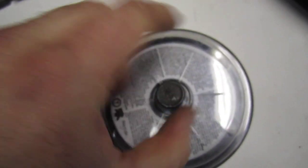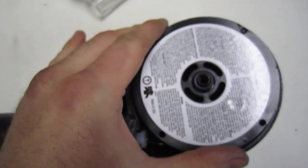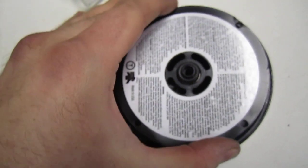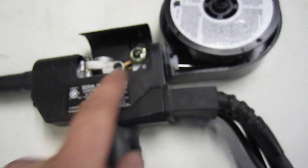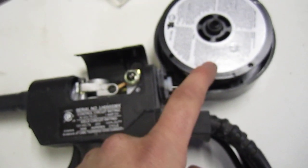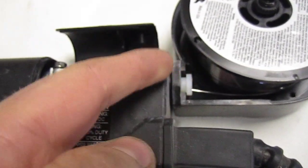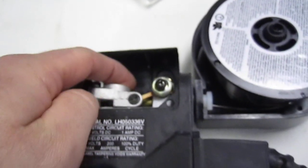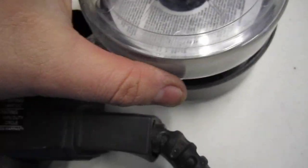When you first get your gun, open it up, put your wire in, and set your tension. This here is your tension knob — you want just enough tension so that it doesn't freewheel. If this wire starts to freewheel behind you, you're gonna end up with a bird's nest and it'll stop spooling. The little drive motor only has so much power, so what ends up happening is your tip burns back.